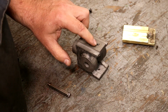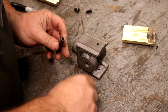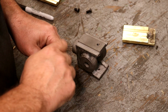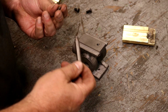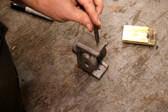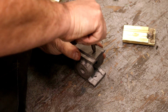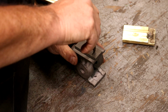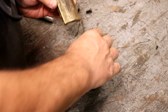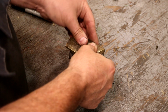Now to transfer this hole, I'm going to use a set of transfer screws, and I've already confirmed that hole is 1/4-20, 1/4 inch, 20 threads per inch. So I got my little 1/4-20 transfer screw here. It's kind of like a set screw, but it has a center punch in the very center. You use the tool to insert it just like so. There's a little hex ground on the end, and you can see it's like a little center punch. We'll put that one in there and make sure I've got A and A, and I want that to be right at the bottom.